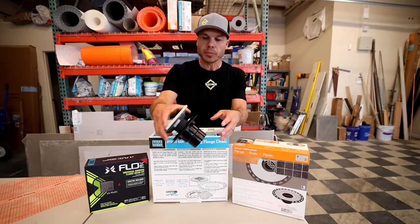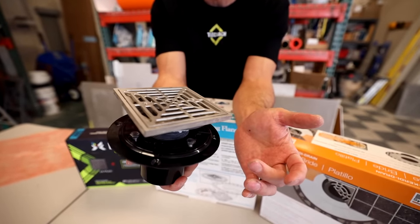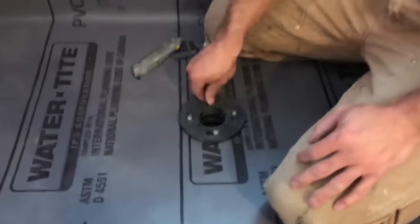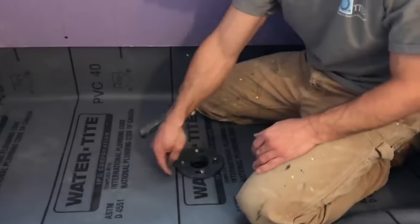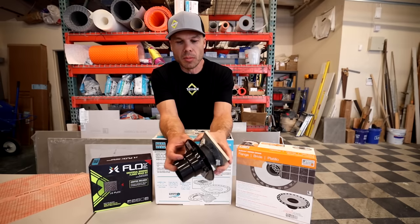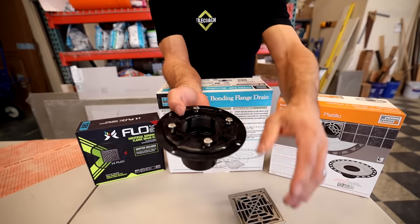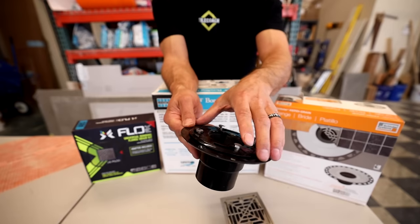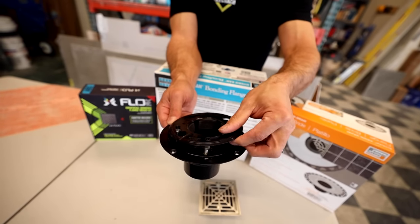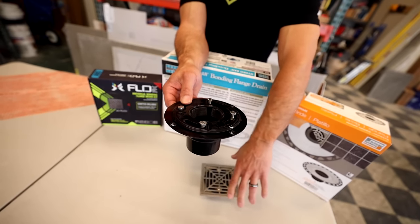This is different than a traditional three-piece, three-stage drain that you would see used with a shower pan liner — a 40-mil pan liner, a hot mop, or a copper or lead pan if you go way back. These still work well, but the way they work is they're three pieces: the drain that screws into this collar, the collar locks down. The way it works is you've got your 40-mil pan liner coming in here, and you put this clamping ring on here to clamp down the second part of the drain on top of the pan liner.